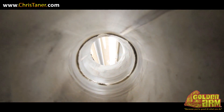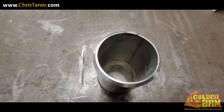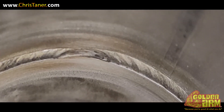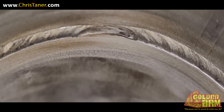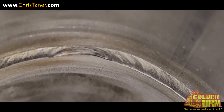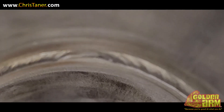As you can see in this root pass here, you see a few inconsistencies — one at the top, one at the side, and the bottom. That may look like something, but it's not. It's just a flat root. It's a pretty good tie-in. That's not a pinhole, neither. You might not be able to tell from the angle I'm filming, but that's a good tie-in. As long as it's flush — just like you see right there on that tie-in — the QC won't have a problem with that at all.